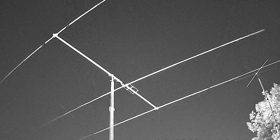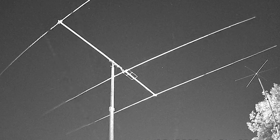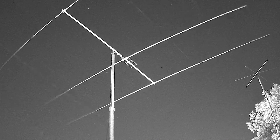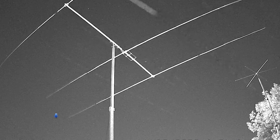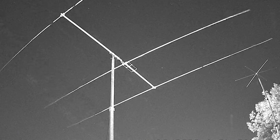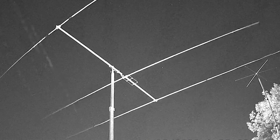At night I can run the antenna up and get on the air, and during the daytime I tend to keep it down. Most of the time on 20 meters I'm not chasing DX during the day — usually early in the morning and late at night. So that's my homebrew three-element Yagi on an 18-foot boom, and it goes up to about 30 feet in height.